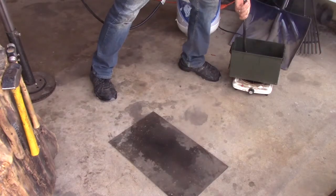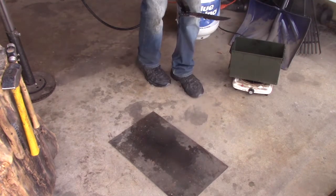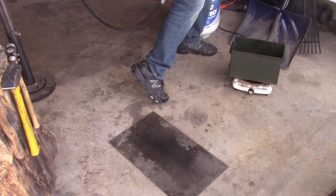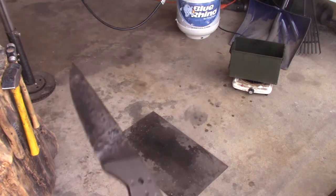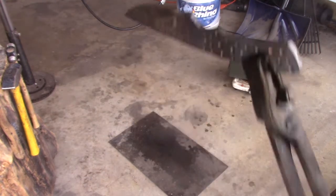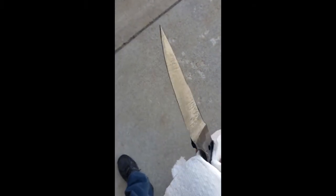So I want to see when I heat treat it what's going to happen. So I've treated it the same as I do all 1095, 3 thermal cycles, preheated oil. I'm looking at it and everything's pretty straight until I get to the blade right after the handle and there's a big warp in it. I think that was just a little bit thinner than the rest.